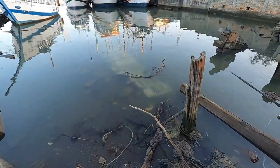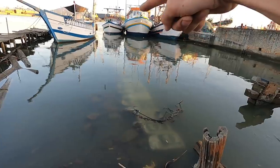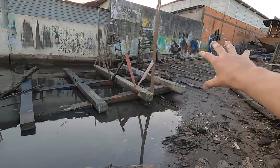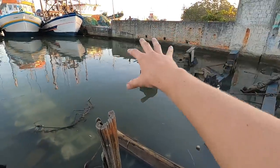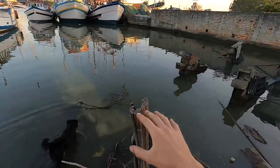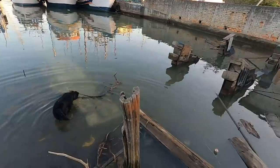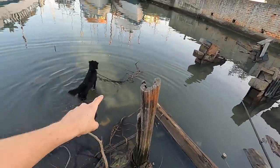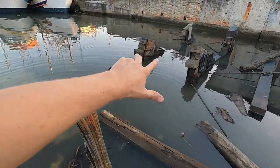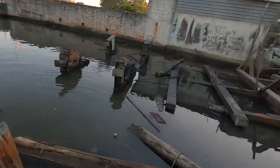They get laid as like they're making a little breaker, a little dam, because every time this trailer, this crib goes up and down, they have to clear all the dirt around it. And they always scoop it over to this side or to that side. But without this dam, it just keeps sliding down every time. So what they're doing now is they're creating this barrier that they can just dig up all the dirt that's in there over here, and it will not slide back down into there.